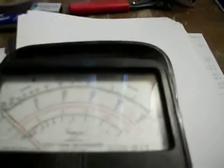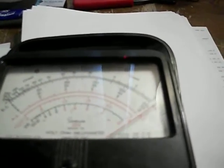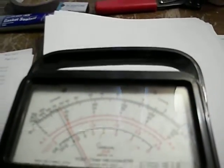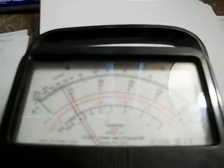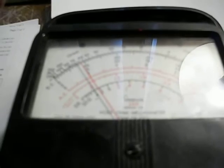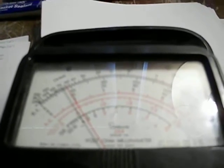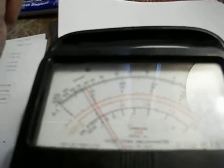As you can see, the meter is reading open. This way is closed circuit, this is open. This is at the 100 range. So it's got some resistance on the R times 100. That's 5,000 ohms — 50 times 100. Yeah, it's 5,000 ohms.